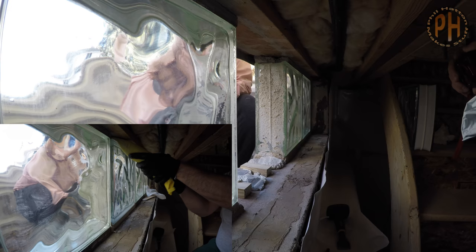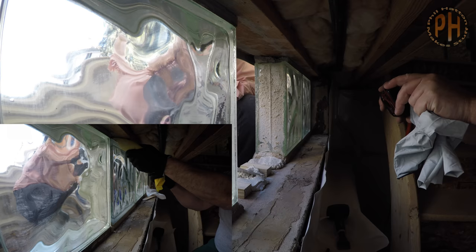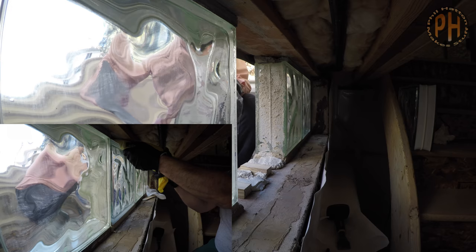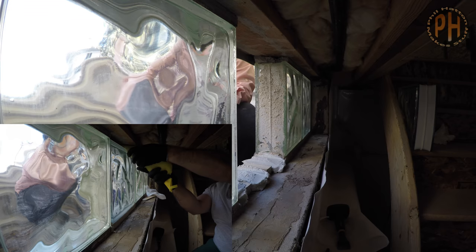So we tried the old cake decorating bag trick, which sort of worked. I'm glad I used the bag, but I would probably have done just as well shoving mortar into the gap with a small trowel and a tongue depressor. You're going to use a trowel and a small rubber float anyway — a tile trowel and a tile float with a rubber surface will do if you have them, otherwise you could improvise with a piece of wood or a shim.